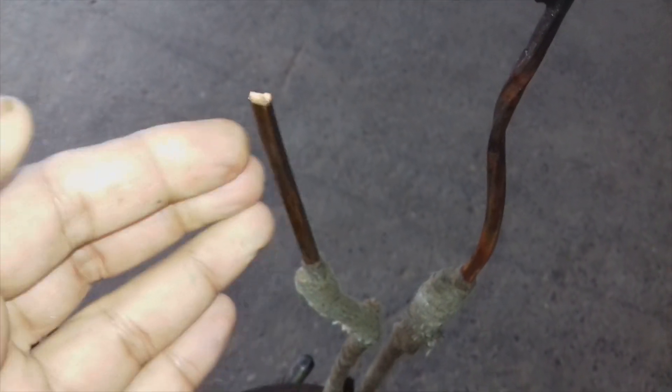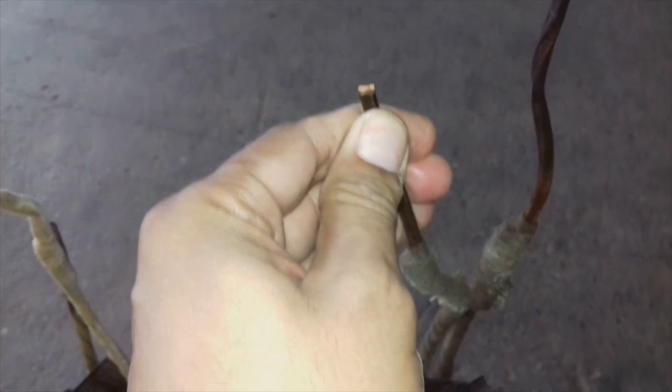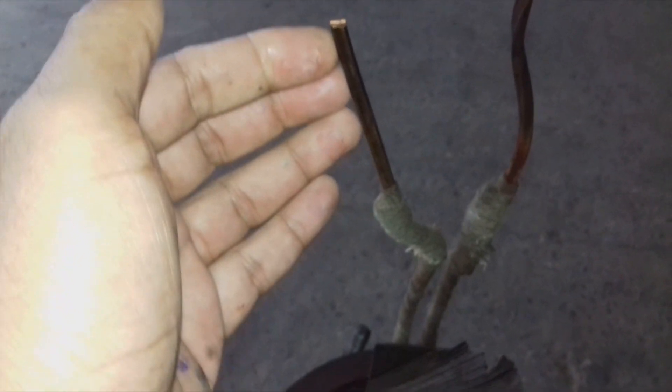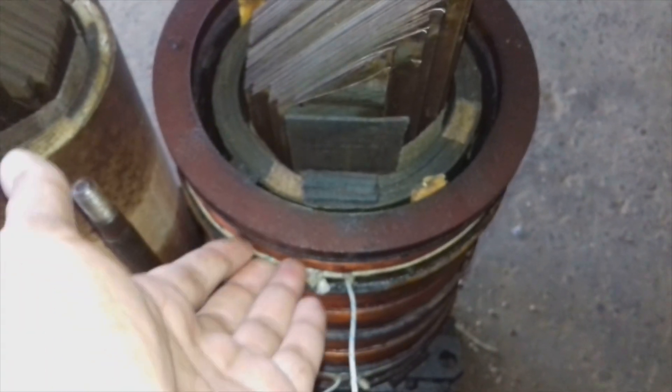Some people have asked why the secondary winding is placed inside and why the high voltage or HT side is wound outside. The HT side is wound with very thin wire compared to the secondary. The secondary or LT side is wound with a much larger gauge wire. The outside winding needs insulation whereas the inside winding needs more copper.